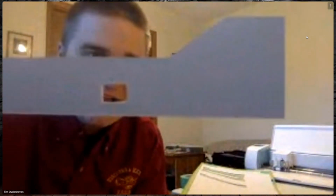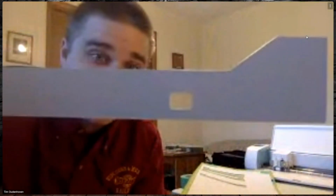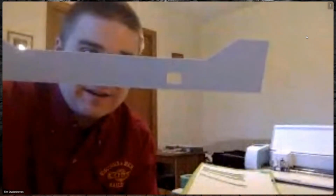Now, notice the limitations here. It's not perfectly square. It likes to round square edges. This is where 3D printing is more precise. But 3D printing doesn't give me the nice smooth surface finish unless I print in resin, which I have, but resin is messy, extremely time consuming, and costs about 15 times more for materials than FDM. So I avoid resin if I can. But that is the part that we made. It's nice and rigid and worked very, very well.